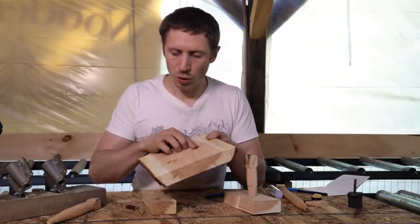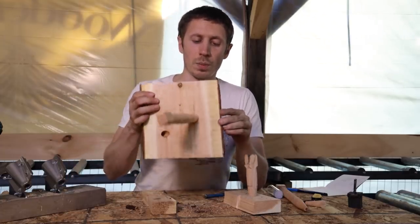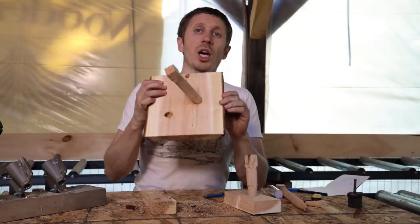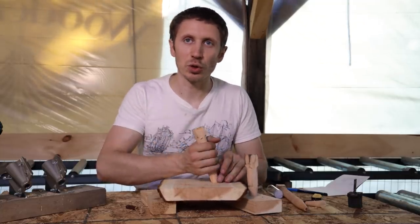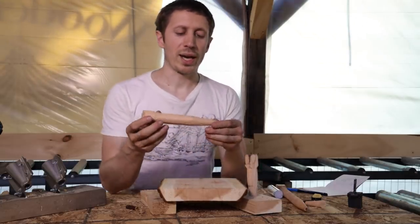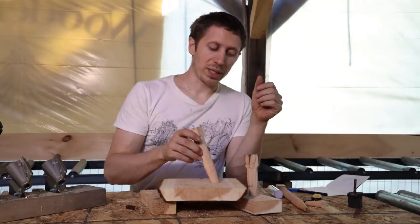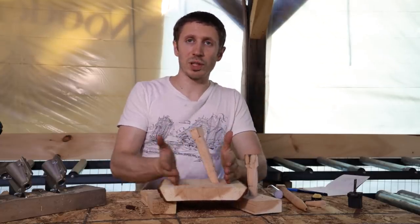So now that we have our tapered hole, you would think you just put that right in there. But as you do that, you want to make sure that you're not gluing these in. Now people are probably going to tell us to use epoxy, use glue, whatever. That is actually not what you want to do. What that acts as is it'll keep it in one place and won't let it move, and then that'll probably act like a wedge and can split the plank.